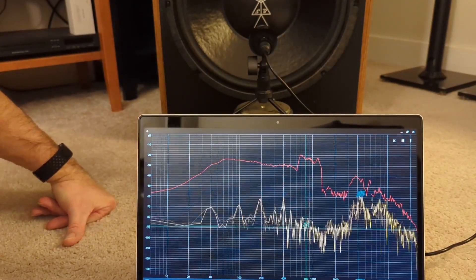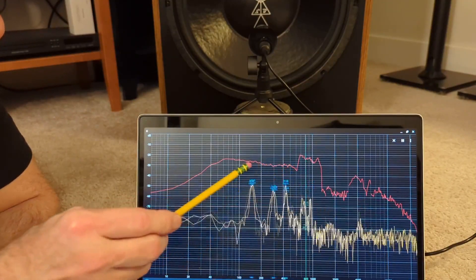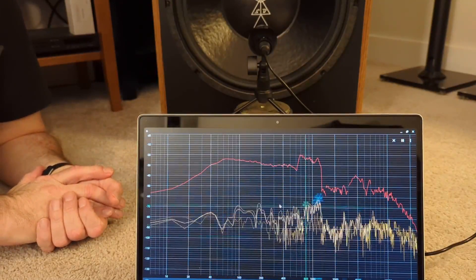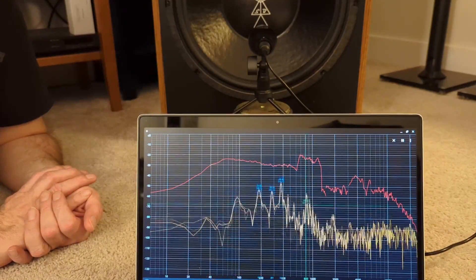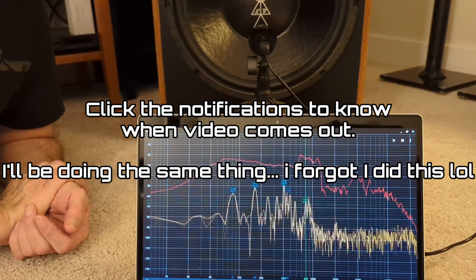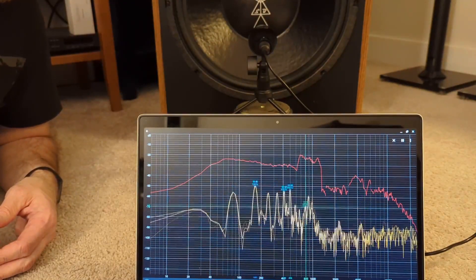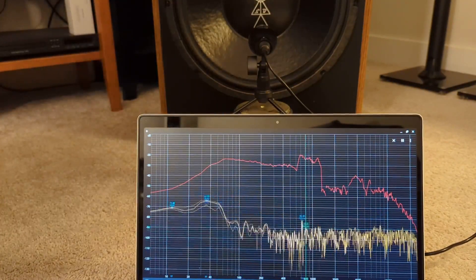Well, this was certainly a close call. There's really very little difference. I think it got tighter along the line and this one was just a hair louder, but I'll have to look at the charts side by side — it's really a close call. Next, we want to try to get more bass out of this. I want to see if the crossover is holding it back before I go messing with the port. So we'll bypass the crossover and go direct to the positive input, running a straight woofer direct.